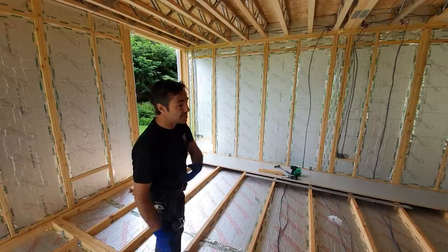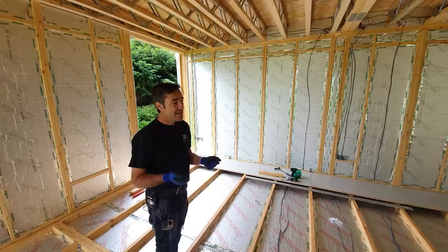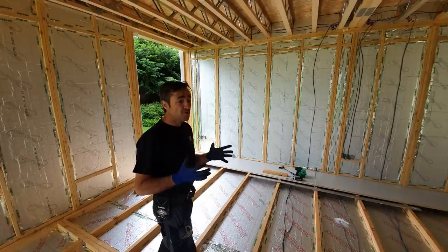And also, I found from using sheet material, whether it's OSB, P5, sometimes you'll jam the boards together thinking they're nice and straight. You'll start working through the floor and you start seeing some differences and some discrepancies. What I'm saying to you guys is pull a line every now and then and check yourself back to the datum. The good thing about this adhesive, if you're using it on the tongue and in the groove, it will help you no end keeping everything nice and straight.